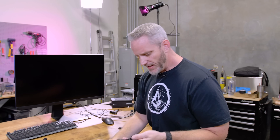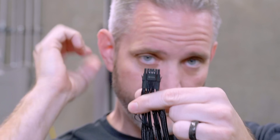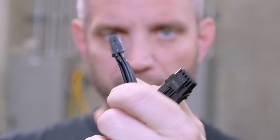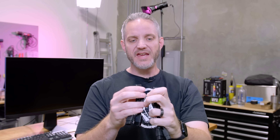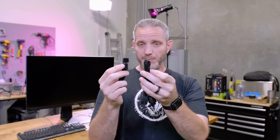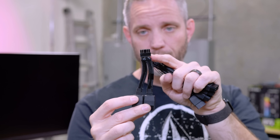It also got me thinking, because a lot of people asked: if this plug is so bad — remember we were concerned about this part of the plug — this is not where our concern should be anymore. It's that part in between the cables and the 12-volt high power plug. People were going: the 30-series had these plugs, all Founders Editions had these plugs, why weren't they failing? Well, if you look closely, NVIDIA did direct pin-to-pin-to-wire — they all have a dedicated wire and pin going into them. NVIDIA did direct pin-to-pin-to-wire on their Founders Edition cable, and these weren't failing even with the 3090 Ti or the 3090, because of the fact that they were dedicated one wire per pin. So they took something that was working and then made it not work.